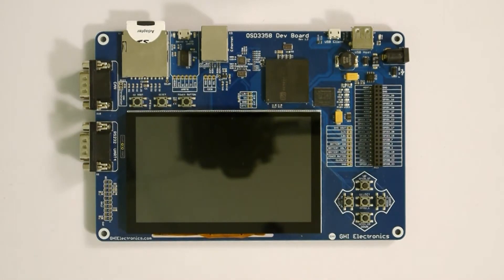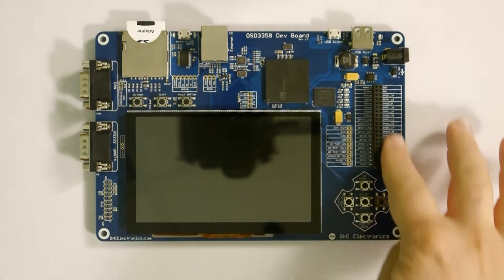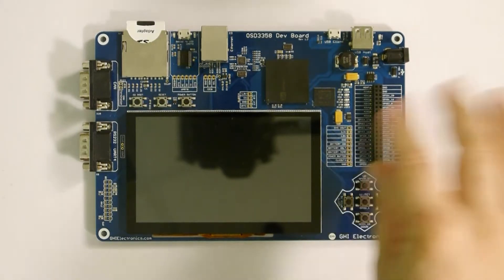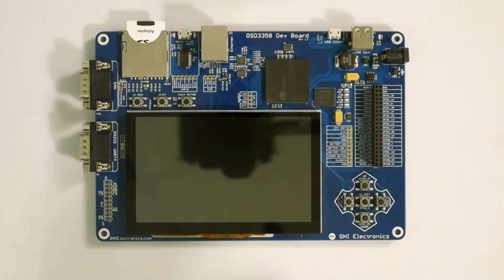We added several other things like Ethernet, and we have CAN and UART on this side. All the other IOs are exposed on a female header, so you can easily add wires and wire up your own circuitry or make a plug-in. This is a really nice way to get started evaluating the SIP and creating a reference design, but we made this even one step easier for you.